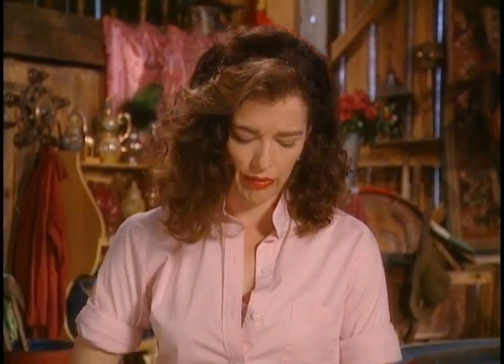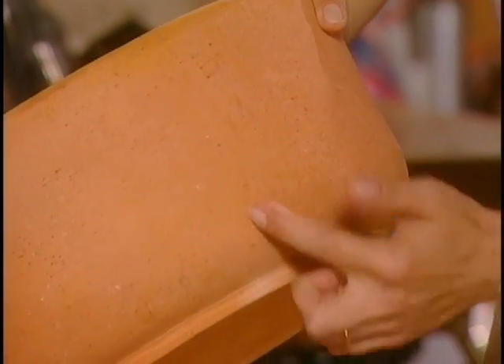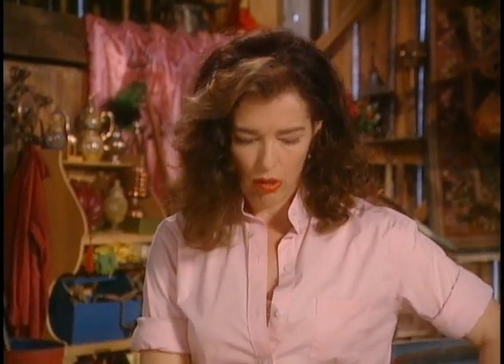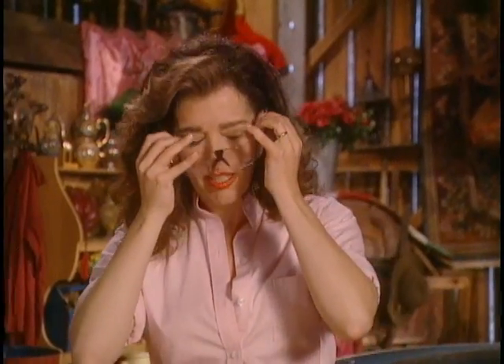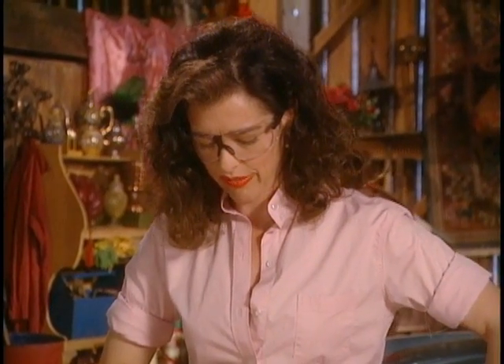Once you know how to use these things, you can install stuff in your tile bathroom, like new towel racks and stuff, because you know how to drill into those tiles. So we'll pick a spot on the pot that's sort of low, but we don't want to be actually drilling on the curve, because then the bit skates around a bit. Oh, safety glasses — the shards of ceramic in your actual eye shouldn't be there, so this is the idea to protect yourself from that fate.